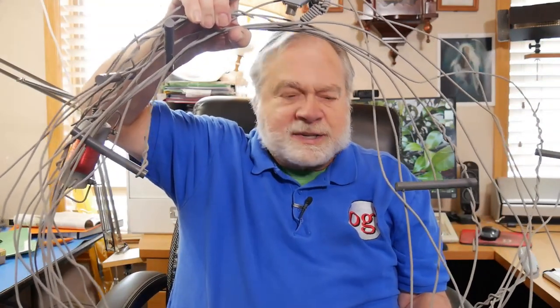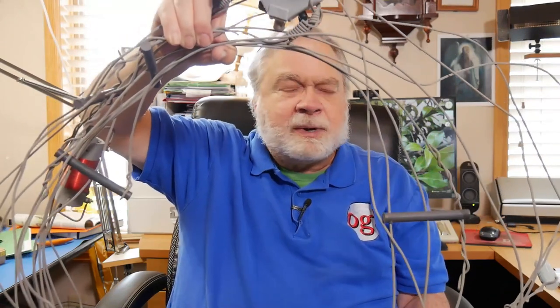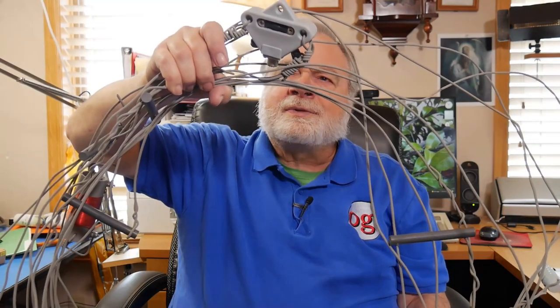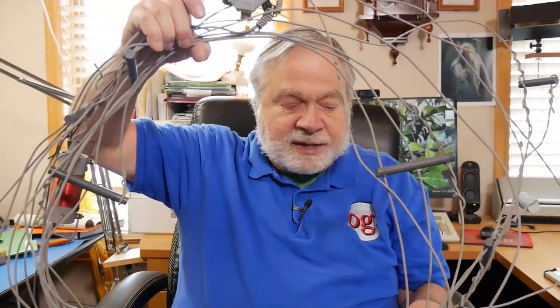It's got nice gray wire that's hard to see. This can be set up as an inverted V even only 20 feet high, so it'd be a great antenna in some HOAs that allow limited antennas but not the great big ones. This was one of the antennas I considered to be the reference station antenna, but because it only covered part of 40 meters, it was not selected. It's still a fine antenna.